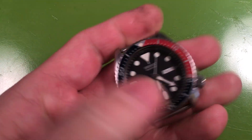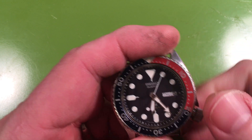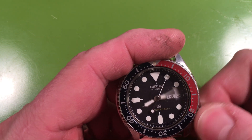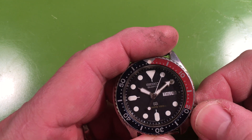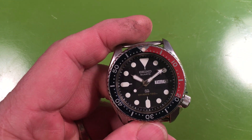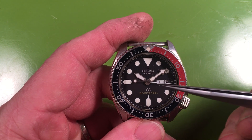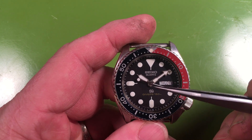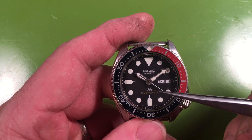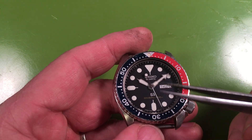But the watch is intact. It's a runner — it's just having trouble clicking over. It doesn't want to click over. I don't know if it's the battery being weak or that the train is binding up. You can see it's trying to move. That feels pretty gluey too. It looks like the train on the front is binding up, because when I move that forward all of a sudden it can start clicking again. When it takes up the slack and tries to push through again it'll start bouncing because it doesn't have the strength to do it. But again that's all easily dealable — none of that stuff is really super important.